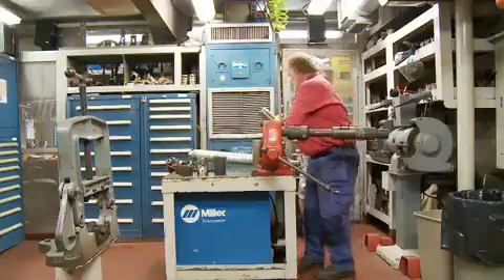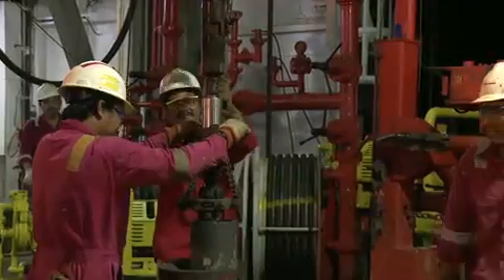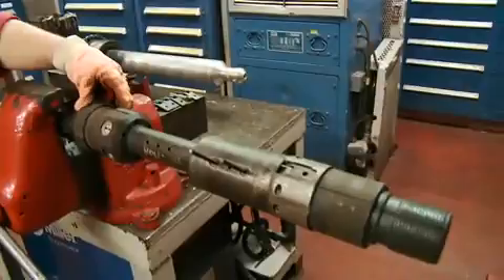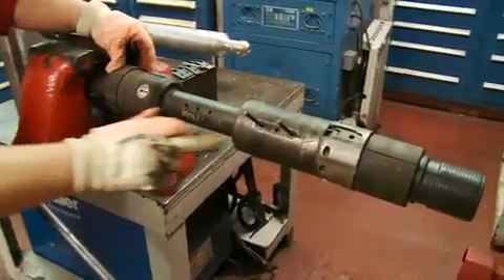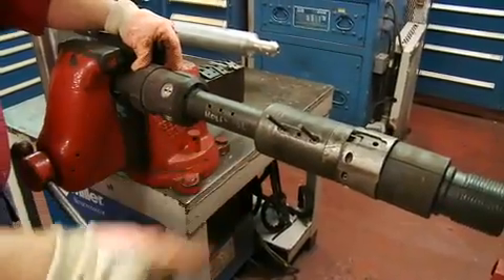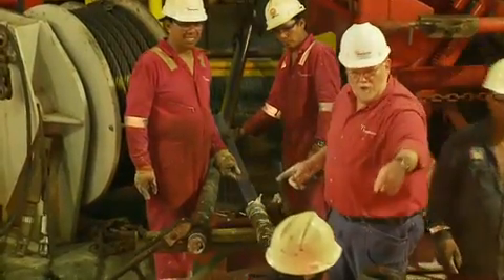This core shop has been on the ship since its beginning. It's a good full-service facility, a maintenance shop, and a place of solace from the outside environment to work on equipment. We're coring in soft sediments, so we're using the APC and XCB coring assemblies. The upper portion of the APC core barrel assembly has two definitive parts that are used hydraulically to actuate the core barrel to stroke it nine and a half meters — taking sediment out from below the drill bit like a cookie cutter.